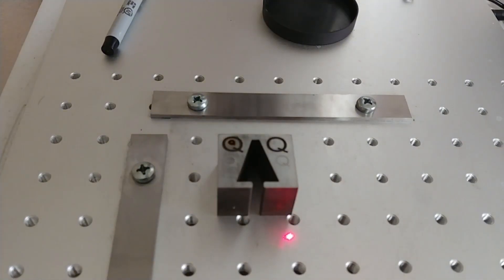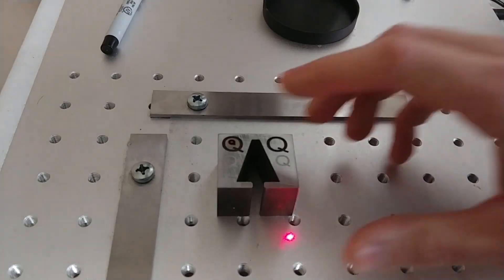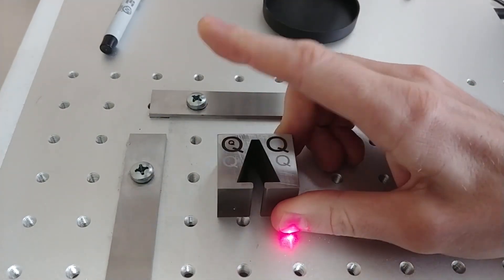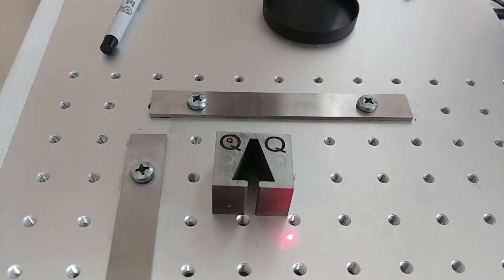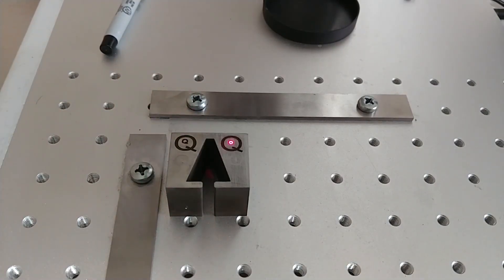Okay, that's about a minute. Definitely got a burn mark around it — looks deep. Now I'm just going to do a circle over here in the other Q, about the same size, so we can actually get the indicator tip in there. Same power settings, same speed settings, same three hashings. Since this is in the two-minute Q, let's do it in the two-minute Q. Remember, the only difference is that this is 100 millimeters per second as opposed to 200 that we did previously.